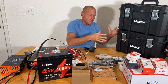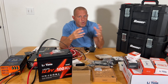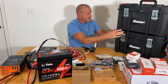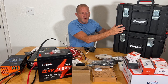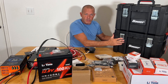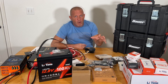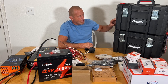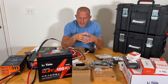After we put them inside the box, we're going to start the build on the 12-volt section, and when that's done we're going to start on the 120-volt with the solar connect section. These are modular boxes from Harbor Freight and they're going to work out great — real heavy duty with little clips on the side. If I'm out camping and all I need is the 12-volt section, I don't have to bring the whole thing. This section will have the charger, the battery, and all your 12-volt ports, so you can just plug it into an outlet, charge it up, and grab and go. You'll also be able to connect it to the solar charge controller inverter section via Anderson connectors.